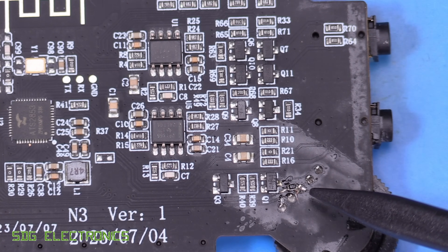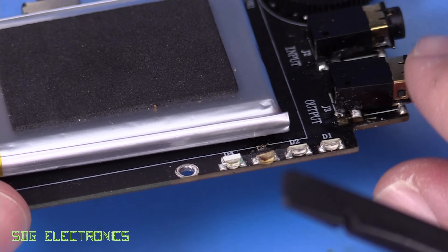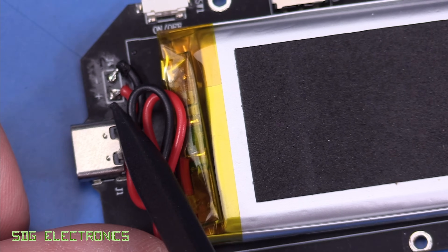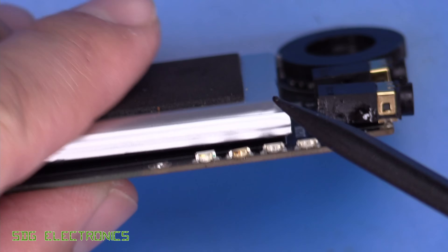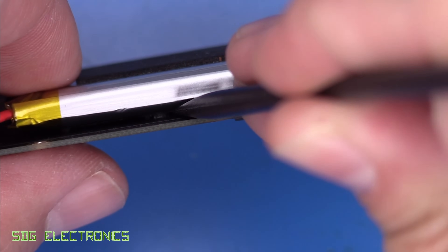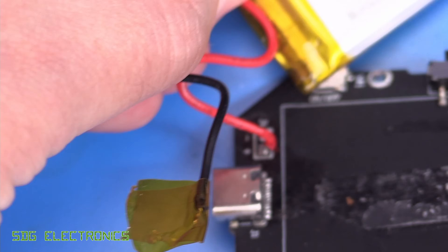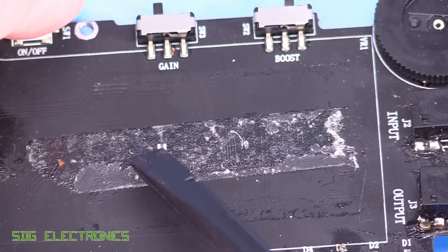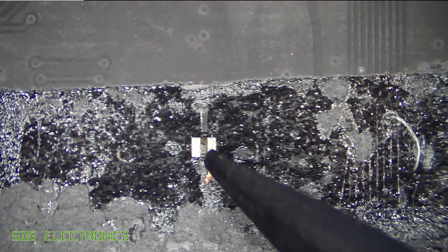We've got a little bit of bodgery going on here — we'll have to look under the microscope in a minute. On the other side is where the jacks were, and that's quite a poorly-looking LED, so I might have to replace some of these. First thing to do is disconnect the battery — this is permanently connected so we need to desolder these connections. The battery came off quite easily with the pry tool. I've put Kapton tape on the lead to avoid any shorts, which should make it easier to work with. There's a pad for what may be a temperature sensor or fuse underneath the battery but nothing is fitted there, and there's a bit of copper randomly in the adhesive.